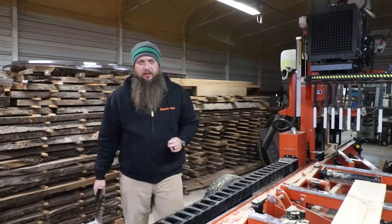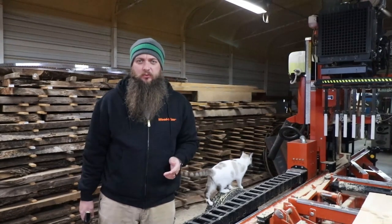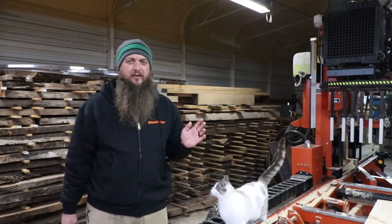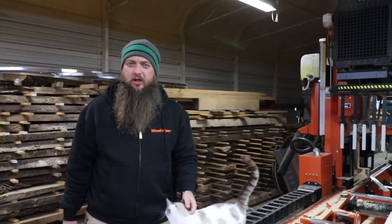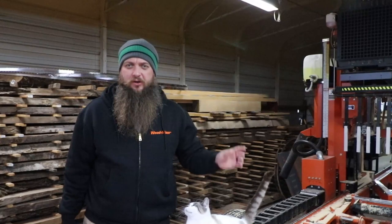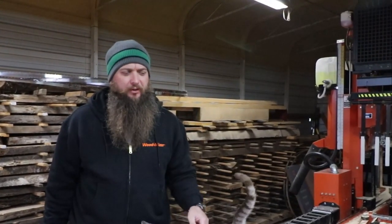So on to the sawing here, and we'll call it a day. We got a white pine to put on. We're gonna do 2x10s on that, a true 2 inches on the thickness, but on the width, I'm doing nominal sizes like you would see in Lowe's. I'm gonna do 9 1/4. The reason being, I got about 4 or 5 12-foot 2x10s at Lowe's years ago. I don't know why I even got them. I've had them for a long time. We're gonna be using those on the barn for headers for the trusses to set on. And I'm gonna do a double header with my own 2x10s, so I want those to match. The thickness is not as important as the width. They gotta be the same width or it's not gonna match up well.